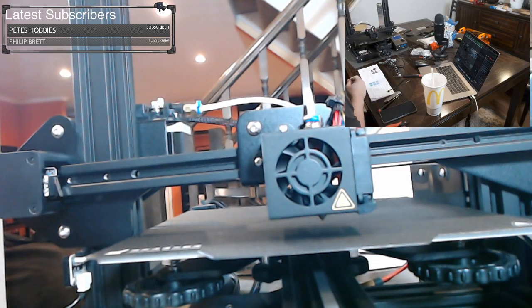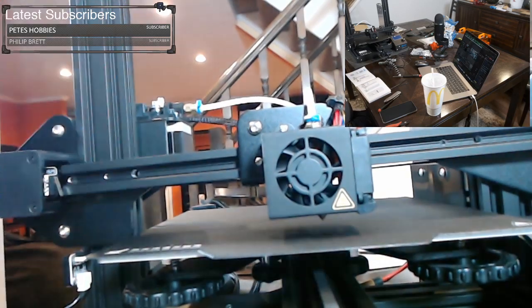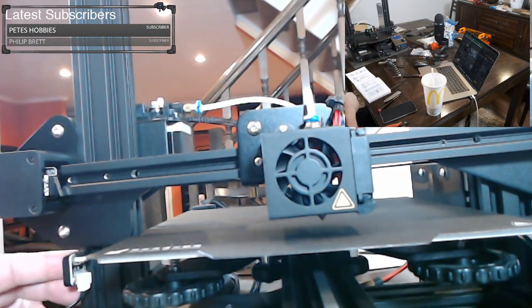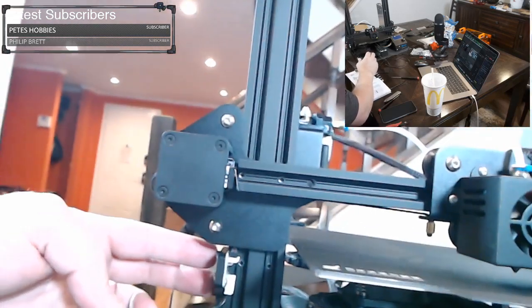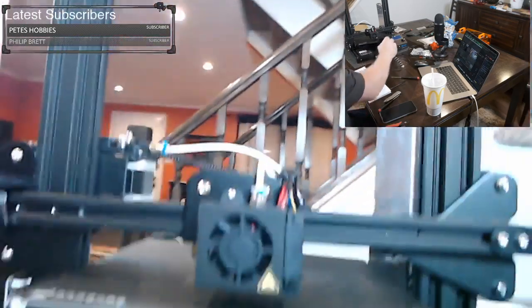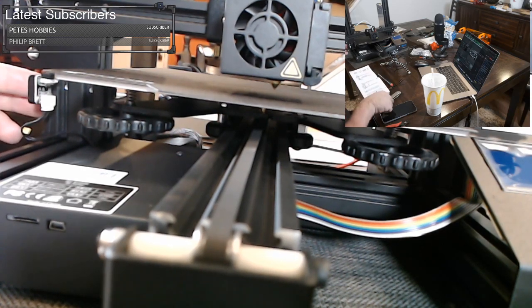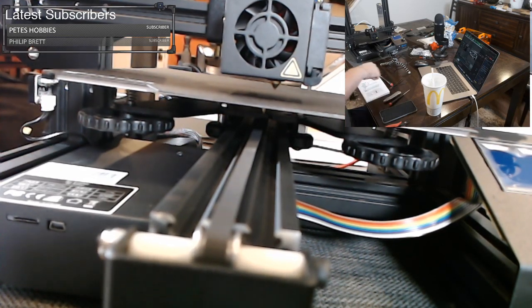I'm just going to double check that, because yesterday I had to really lift it up, but today it looks like it's not even going anywhere near low enough. So what I'm going to do is loosen these two nuts over here on the Z end stop. So you hear that click? That click means we're at the bottom. And it's fine if it has to stay there, but that is a little bit of a gap. I'm gonna close that gap up just a little bit if I can. So that is my 3 millimeter.